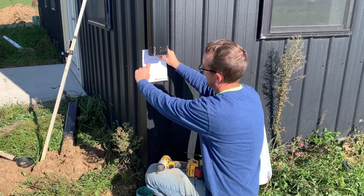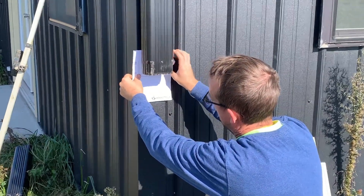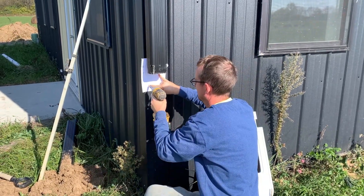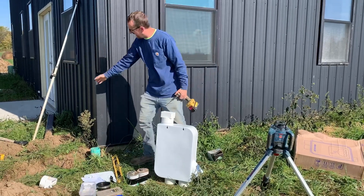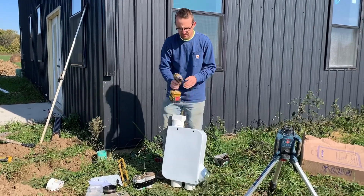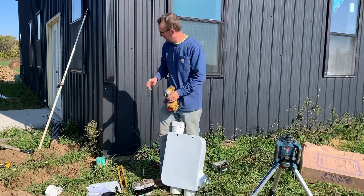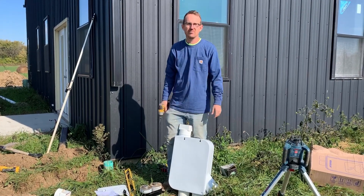I got my three inch gap marked out here. I just poked a little hole in the template. I'm going to line that up with the bottom of the downspout, line the downspout in between these lines here, and that's the position for our mounting screw right there. Now because this Mondulin is sticking out past the building, we're not going to just rely on this one mounting position to secure it. So I'm going to pre-drill two more holes below this mounting position in line with it, and we're going to use those holes to mount two more screws into the metal siding so that we can get that Mondulin nice and secure.